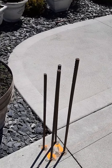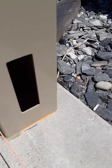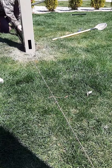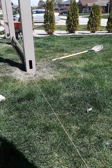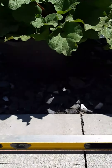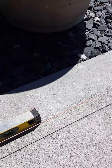What we're gonna do is cut the post to length. We're gonna maintain about a two-inch bottom space. We've cut this one and we've got our string set up so that we maintain the string line. Some of our posts on this job are actually in the customer's yard — those are set as shown in previous videos. We follow the same steps here on this patio, which has a grade sloping a little bit.